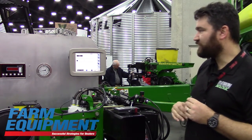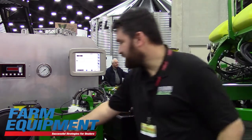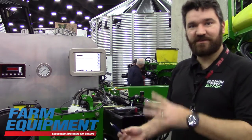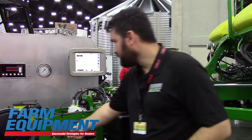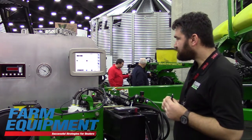It just turned off, showing how the proximity sensor works. Basically, when you lift the planter off the ground, it triggers the switch, waits 30 seconds, and then turns the planter off. I can just touch it with a piece of metal and it will come back on very quickly.